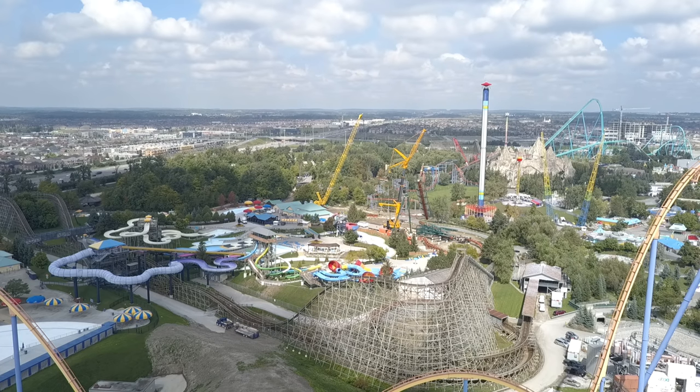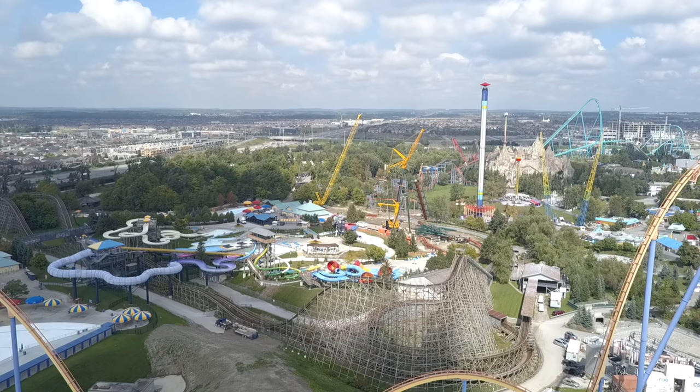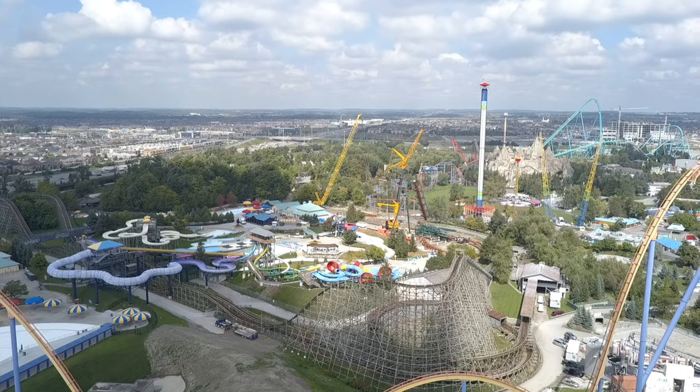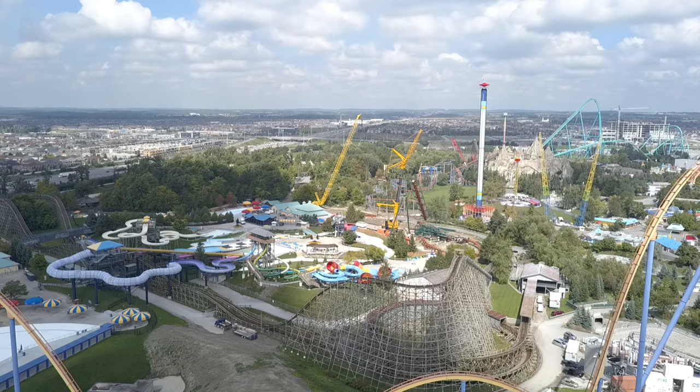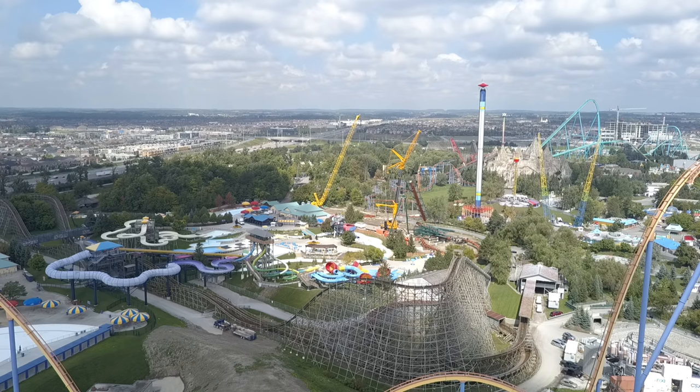And then what this crane does and how it's able to lift one piece of track is actually called chain falls. So the chain falls hold the track piece at a specific elevation. So as you see here, the track piece is already at the exact elevation it needs to be, 47 degrees, for quick and easy install.